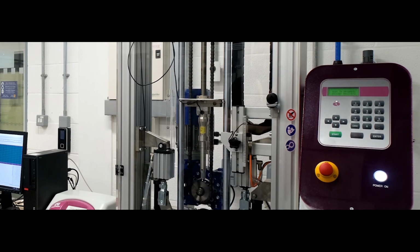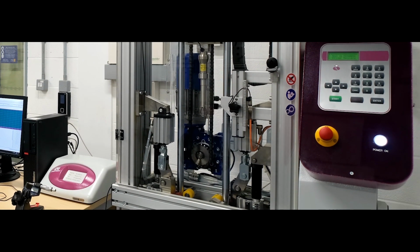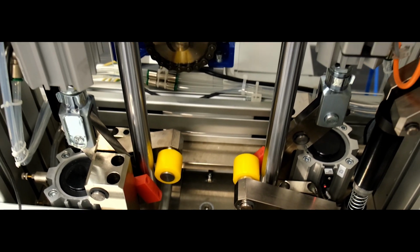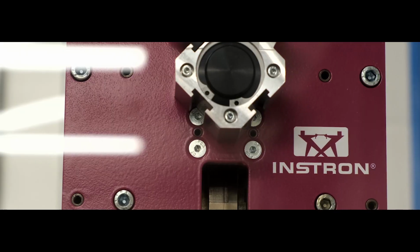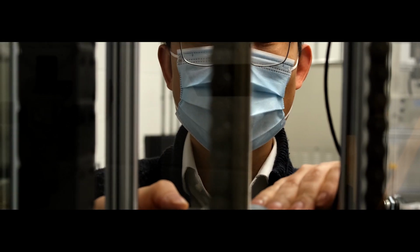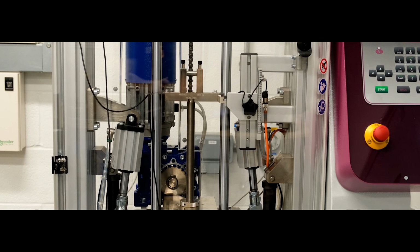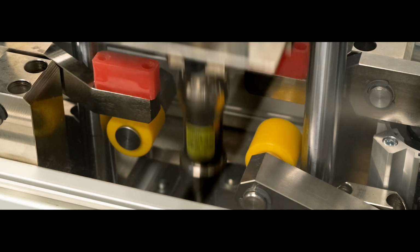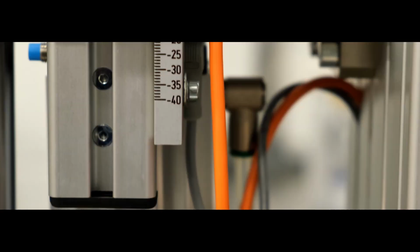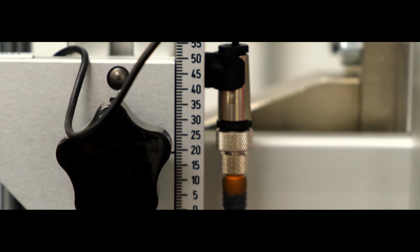This machine consists of three main parts: a turret, a test chamber and a control box. The turret is the upper part of the machine. Inside the turret there are a motorized crosshead positioning system, a set of weights to deliver a range of impact energies, changeable tups and inserts for different applications, an anti-rebound system preventing secondary impacts, and a photocell used to measure the velocity of the tup just before the impact and to activate the tup anti-rebound system.